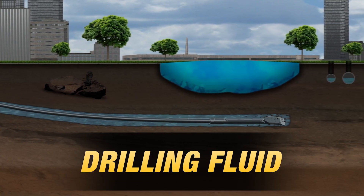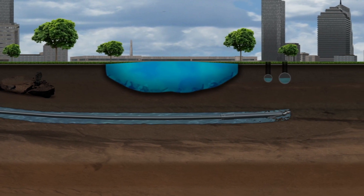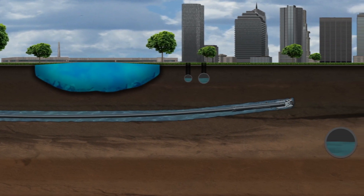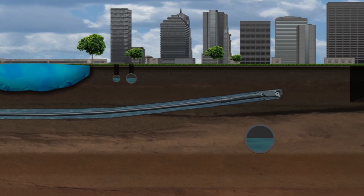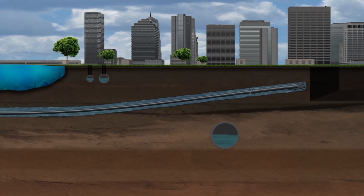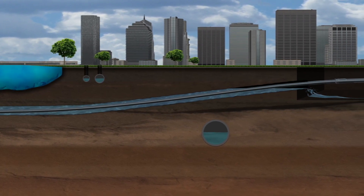Selecting the right drilling fluid is critical, as clay material will want to ball up around the drill bit or reamer instead of flush cleanly from the hole. Select your additives based on whether the clay is reactive — swells when moisture is added — or non-reactive, meaning it doesn't expand with extra moisture.